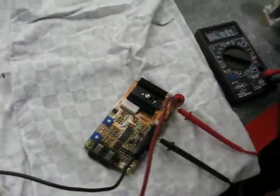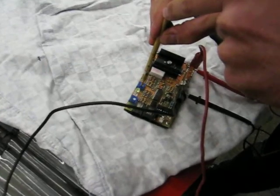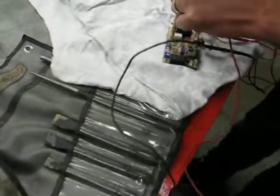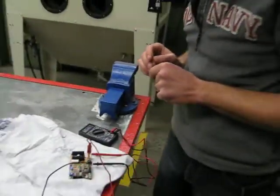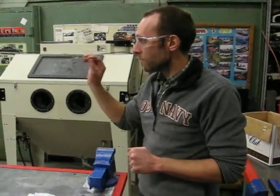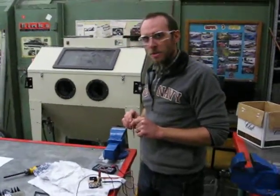Let's take a look here — I can feel a little bit of heat. Let's shunt some more amperage. The power supply's going to blow up! It's beautiful — we've dropped the voltage down even lower. So we've checked this one board and it seems to be set perfect. Tomorrow I will get all the other students to check all the other boards and make sure they're all set at 14.8. That's where we want all the PC680s set up at. We're going to reset all those, charge that pack — I want to see them all shunting, see that little LED blinking, and make sure all the batteries are good.